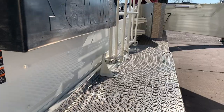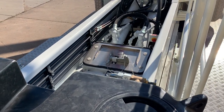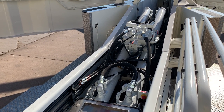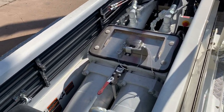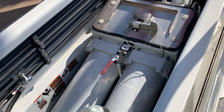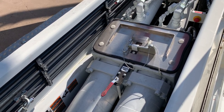The 65 has the 2525H-6 pump kit, which outputs 213 cubic yards an hour at 22 strokes per minute, with 1,169 PSI of pressure on concrete. In front of that, we have our water drain shutoff valve — in the event of freezing temperatures, you can close that off so your water box drain line does not freeze. Again, this pump is going to Texas, so that should not be a problem.